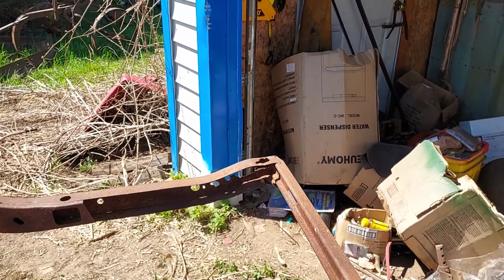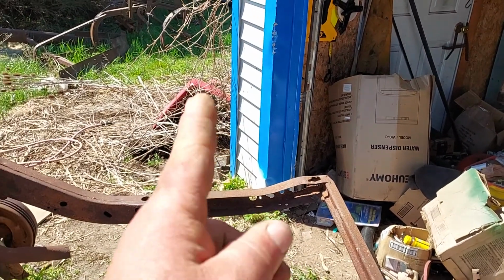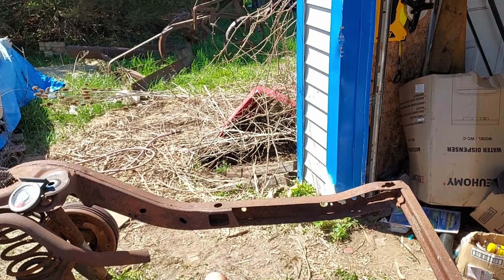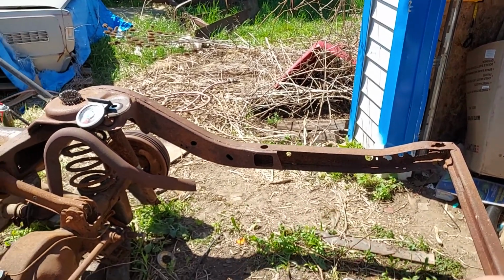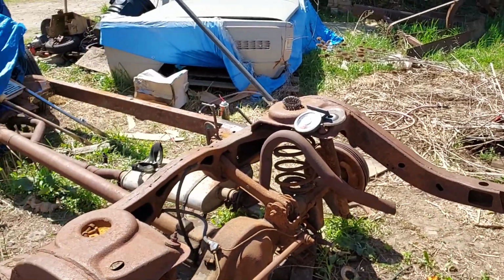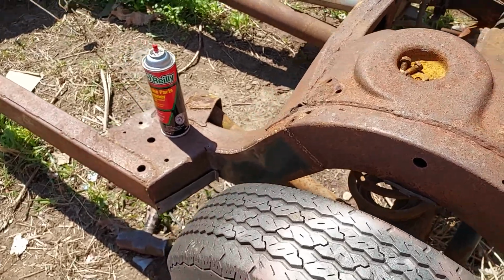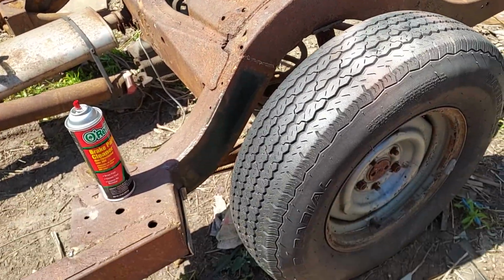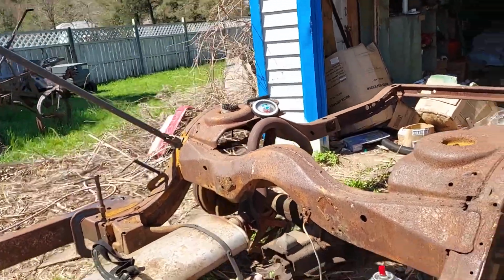Like I said, that'll get cut out, plated, and overlapped, because you don't want straight lines, because it can form a crack. Everything's still got to be able to move, so you don't want to do too thick a steel, because then you're going to lead to other issues. So you want to basically keep it the same size. See that patch there? That one I got to put in. I thought I put it in, but I guess I didn't weld it in yet.